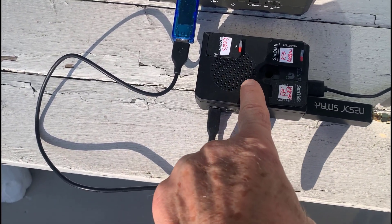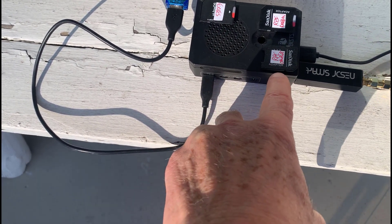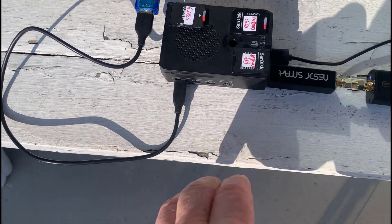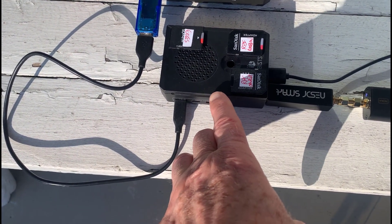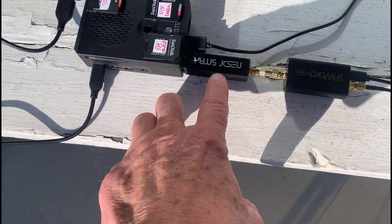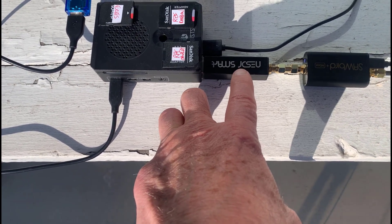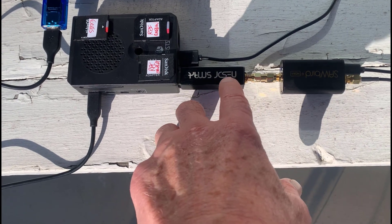Over here is the equipment. There's my Raspberry Pi 4. I've got different images depending on what I'm doing — an image for GOES satellite, a regular Raspbian image, and the one I'm using today is the OpenPlotter headless image. The signal from the antenna comes in here to a bandpass filter at 137 megahertz with a low noise amplifier built in, all SMA connected, and then it goes to RTL-SDR version 2 with a metal case. This one's fairly accurate, so the PPM is between minus 1 and 0, usually around 0 depending on the temperature.